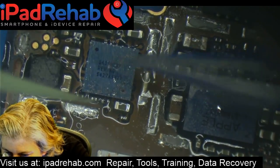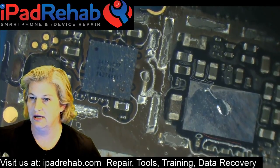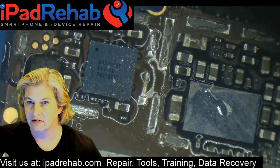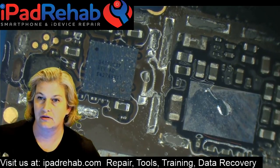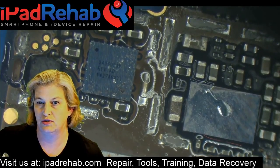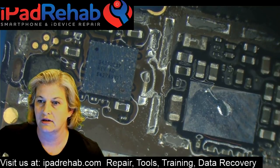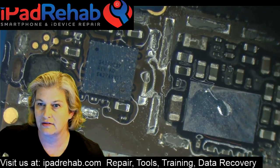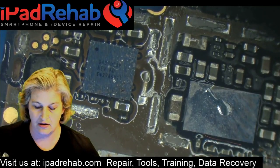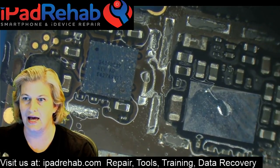1, 2, 3. So here's where we could check something like ZXW, which I'm not 100% sure is plugged in here. Let's see, window capture number 8. Do you see ZXW? It does not. Okay, so we are going to have to skip on that. Yes, those two pads that appear to be stuck together under there are both NC, not connected pads. So not connected, not worried about it.